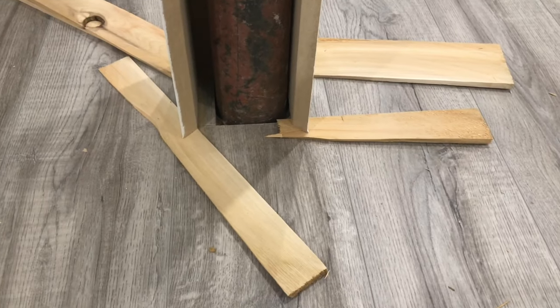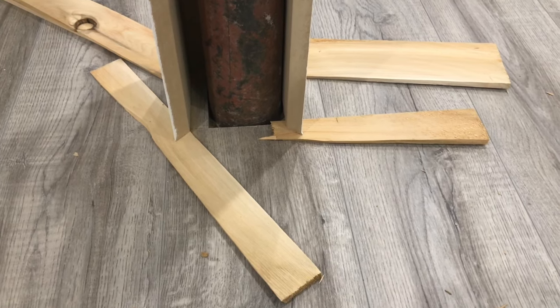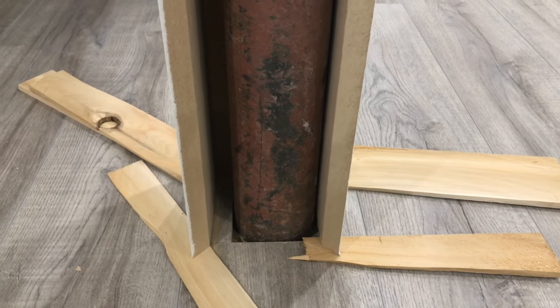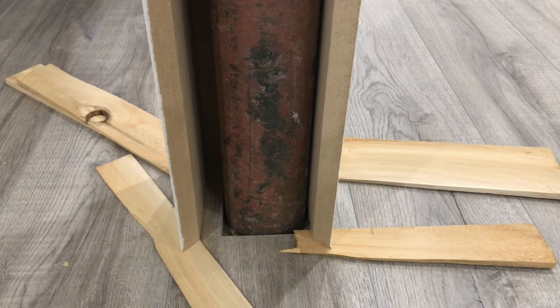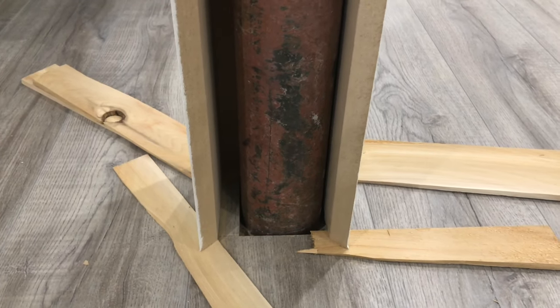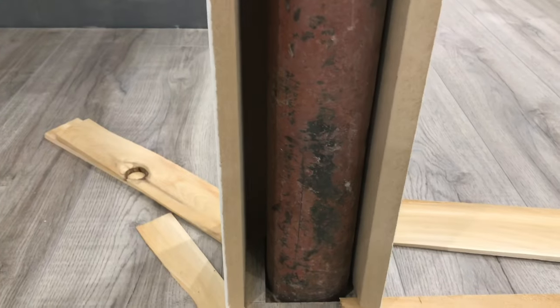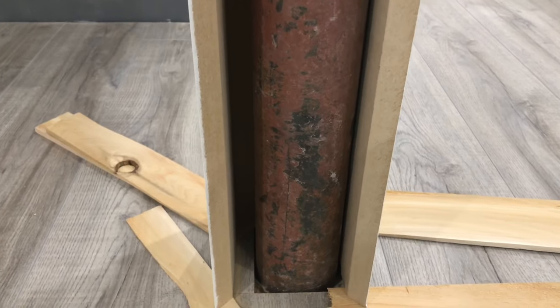This is how I shimmed it tight — I shimmed it on the bottom using cedar shims and you can see there's an odd space in there. That's because the original column isn't level from when the house was built. So as long as our post cover is level, that void in there I'm going to be filling in with foam, and I'm going to be doing this in stages.